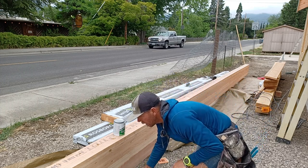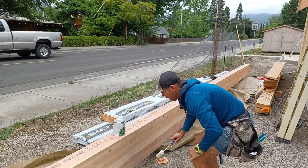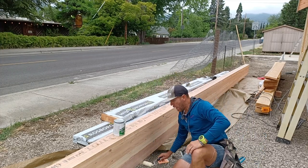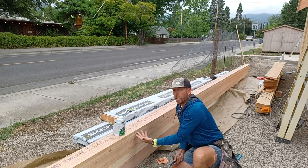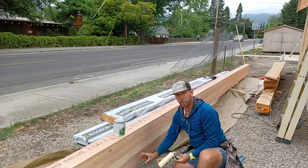I'm using a water-based sanding sealer. I'll also roll the bottom and then the first few inches at the other side. This is all going to be covered by rafter and insulation, so I'm just really trying to coat the bottom three inches.